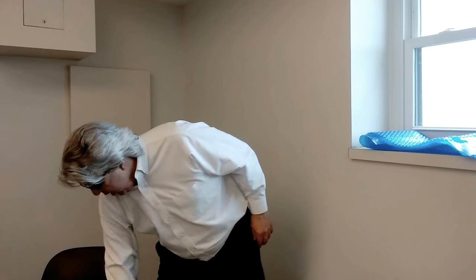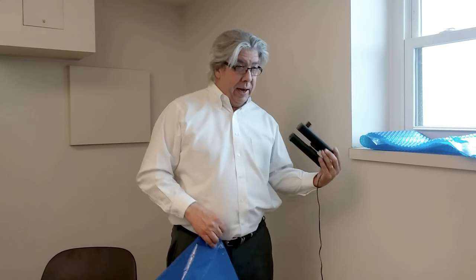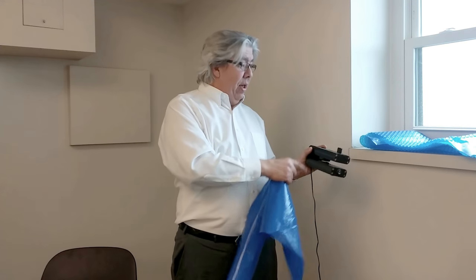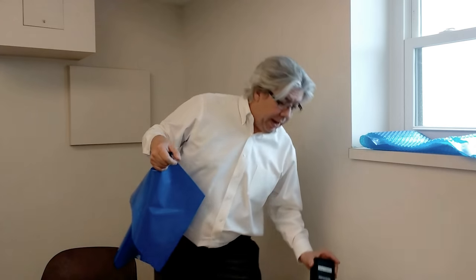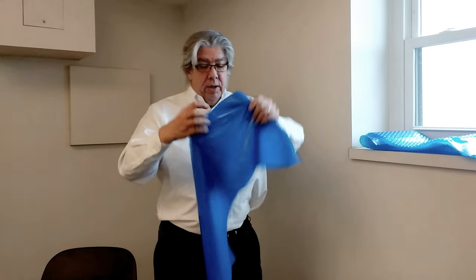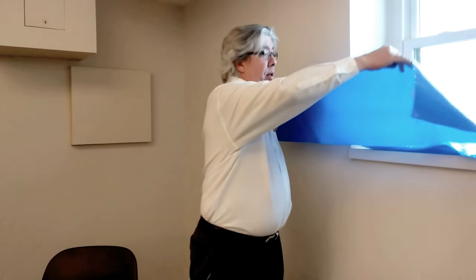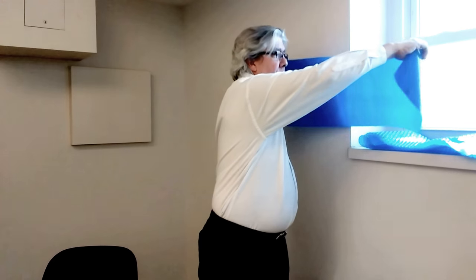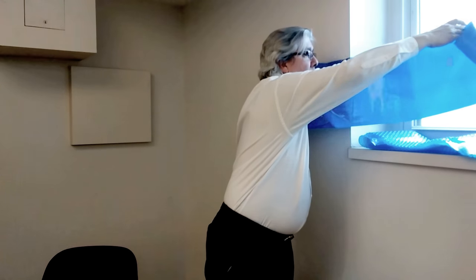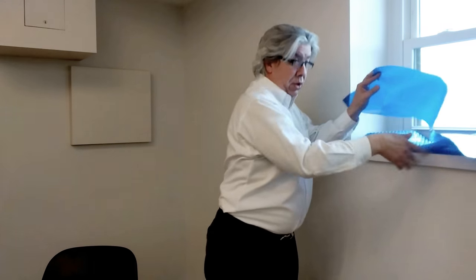We have a range with this customer. What we use to measure the opacity is interesting — there's a light source and a photo cell, and we zero it out, or actually put it at 100, and then we put a piece of film in and we can measure how much light is getting through. This is considered by our customer an opaque blue, but you can see there's quite a bit of light getting through to the naked eye.